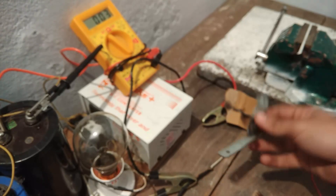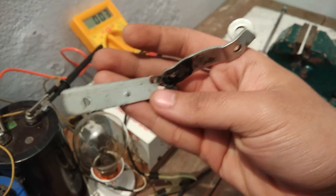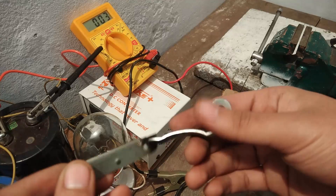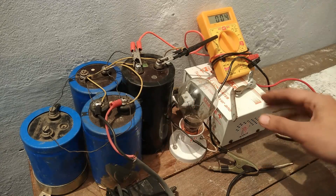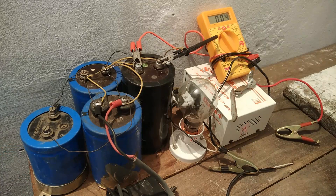One thing to be learned from this is that no matter which type of welding you perform, it is almost impossible to weld iron and aluminium together. But iron-iron bonds are easily made, and so are aluminium-to-aluminium. It's like a new invention — how we can boost the charge from a laptop charger and store it in a capacitor bank to do easy spot welding without any electrode or additional materials. This is still a demo. For bigger materials, we are going to need higher capacitance. I am doing around 35,000 microfarad — it would be much better if I move towards around 100,000 microfarad, then I can weld even thicker materials. And the best part is that this welding machine does not produce any harmful fumes for your lungs, unlike electrode welding.